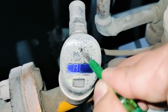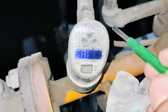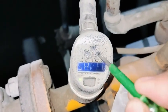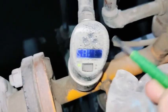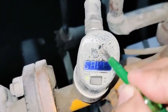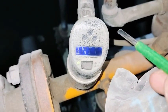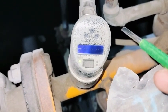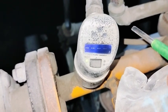After showing OK, press the E button and it shows SAVE. Press plus for YES. The menu appears again — press E button. This saves the calibration. After this it shows INITIATE, sometimes blinking, and then returns to normal display.